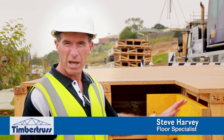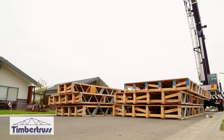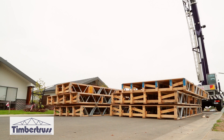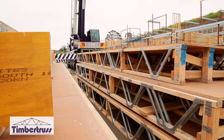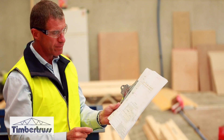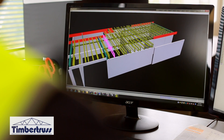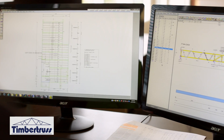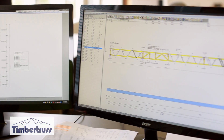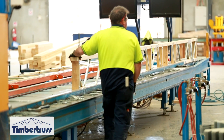Cassette flooring is a structural element, normally floor elements that a builder would make on site. What we're actually doing is putting it in a factory controlled environment. The design is the most critical part, handled through our detailing department. From there it gets converted from MyTech through to our CAD, which then converts it through the machine screen, and from that machine screen the joists are set up specifically to the spacing required.